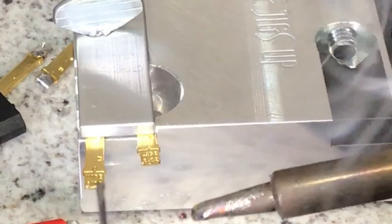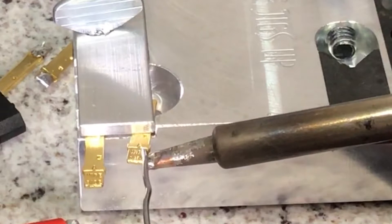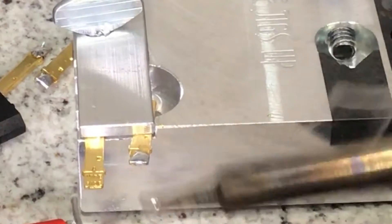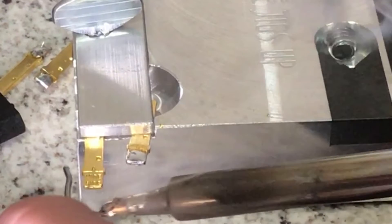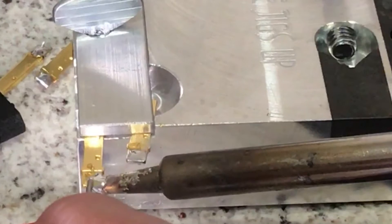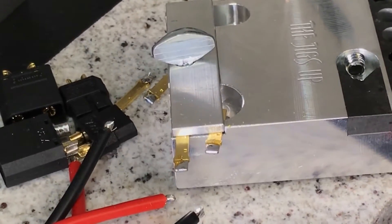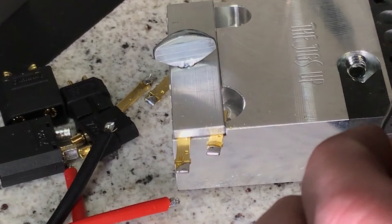I've slowed this down so you can get a better understanding of exactly how I touch the soldering iron to the connector and put a little bit in between so the heat flows right onto it, making the soldering quick, easy, and oxygen-free. As you can see, I actually hit this again with more solder, which was a mistake — I did not need that extra solder. That's the habit people fall into, so pull back. The purpose of solder is to connect the wire to the connector; although solder transfers electricity, it creates resistance.